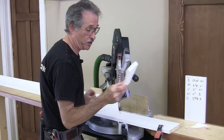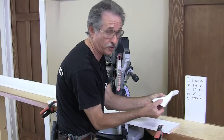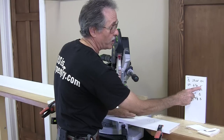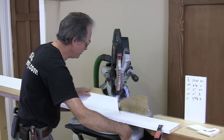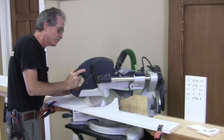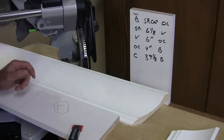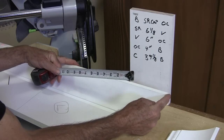There's our second piece — you can see how these miters made up very nicely. There's our self-return with a self-return cap. Now we've got to cut the third piece, and it's got an inside corner on the left hand end — it has to, to mate up with the inside corner on the right hand end of the previous piece. This is an outside corner, so to make a mating miter all I have to do is swing the saw in the opposite direction and make the cut. This piece is 6 inches from that inside corner to the outside corner, so all I have to do is hook my tape on this inside corner — and you can always hook your tape on the long point of an inside corner.